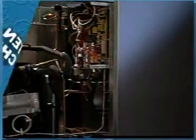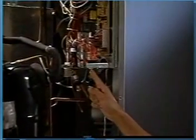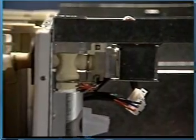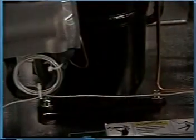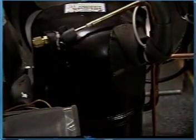To perform the 10-minute checkout procedure for the KM Cuber, restart the unit and verify the operational sequence. Make sure that all components cycle on correctly, from the 1-minute fill, through the initial harvest, and into the freeze cycle. If a component fails to cycle properly, check that component and its controls for problems.